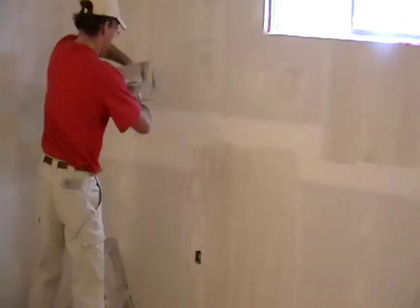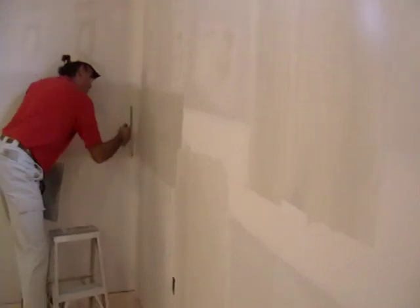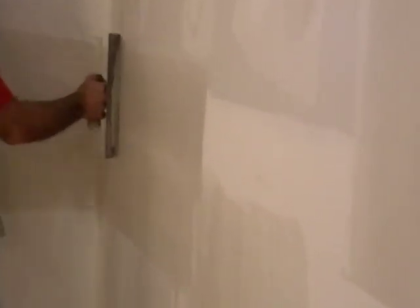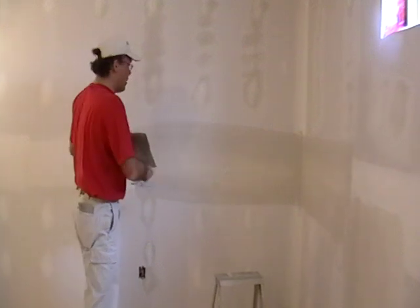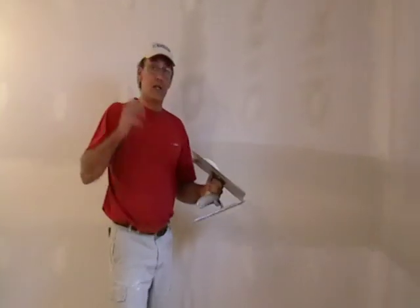We might as well do a little shot on this one here too. I'll load it up thick. We just won't cross these butt joints yet like we did last time - we'll let them set up before we do the angles. I just pushed against the bottom, pushed against the board at the top. From here to the center, tilt up and push hard. Tilt up and push hard. You're not leaving the thickness for the finished coat - we already did that on the second coat. The job of the finished coat is to take out those little bubbles and lines. So you're seeing the angles, the butt joints, the paper joints, and the screws - and that is a finished coat for those. Sanding after this is very, very minimal - still needs to be done to blend board with mud, but don't leave extra mud on there for nothing just to sand your guts out. Nobody likes sanding. The second part of today's segment, we're going to do those inside angles and that bullnose corner bead in the closet, just for a little lesson there. See you in the next one.